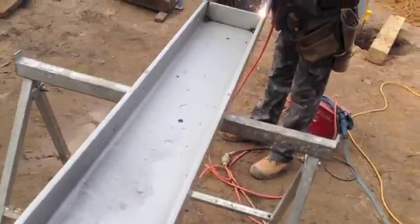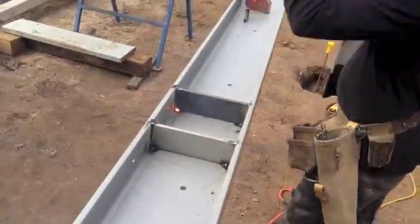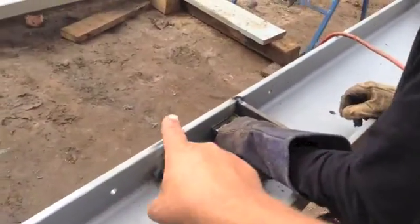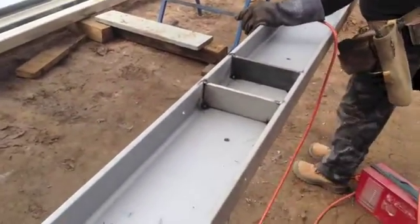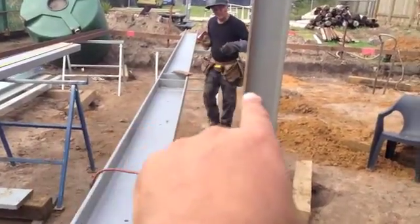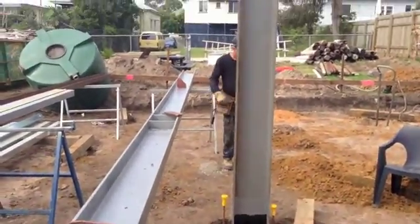Cameron's now doing the plates that hold the next PFC, which is the portal frame for upstairs. So what happens is the portal frame goes from there up — we've got a three-metre post going on top of this up to the roof to catch another beam that goes across the top of that. So he's putting those in where they've got to go. There's our other gussets just there for this beam, this post, and past that are the next ones for where the post is upstairs.